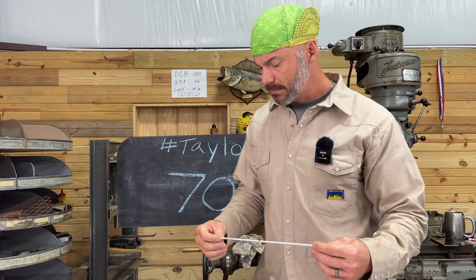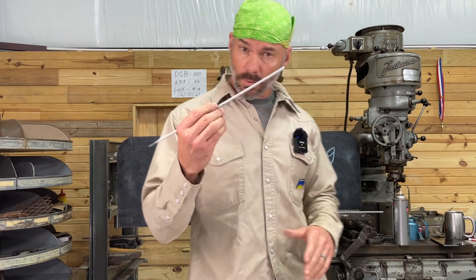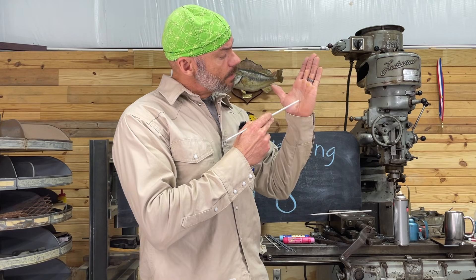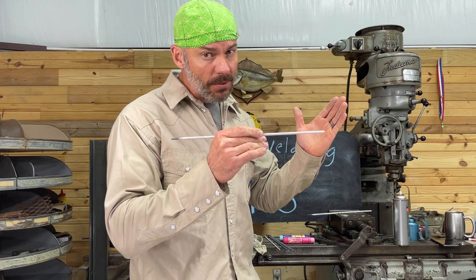So that's one thing. The 3/32 is just an awesome little welding rod. Now if you're going up something with a 1/8, you can do any of these flat. If I was going to do something flat, I'd lay this 5/32 on it — the only reason I wouldn't use something bigger is because it hurts my welding machine. These things take a lot of power to push. But a 1/8 uphill — if your plate's thin, you better get back to that 3/32 and turn it down, because these things carry a lot of heat and take longer to run. That 6010 is fast. Same deal with your 1/8: go over there and hang out, and on your cap you'll have to speed it up a little bit. The hanging out is for the filling.